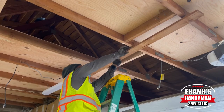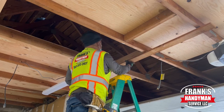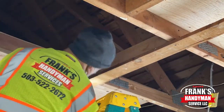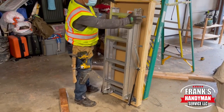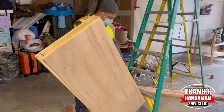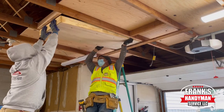If you read the instructions, it says they recommend you put a temporary support — that's what we're putting right here. We just got a small section of wood and we're going to place it there temporarily. So once you have that, we can go ahead and get the attic ladder and we're going to be lifting it up and placing it on that temporary support.